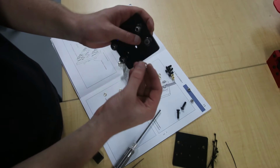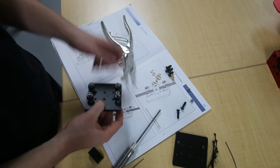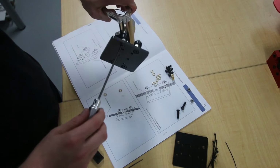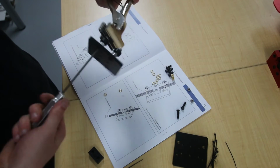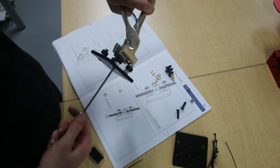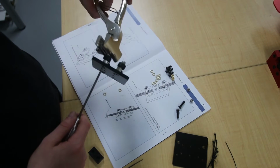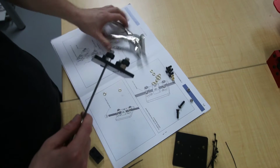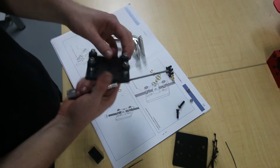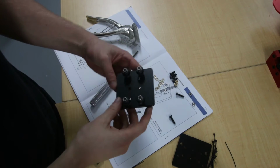So put these nylock nuts on backwards, with the nylon going on first. They sit better up against the bearings and let the bearings still turn. So the bearing can still turn. Loosen it off a bit. The same for all of them. And there you have it, guys. That's the wheels installed.